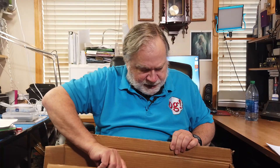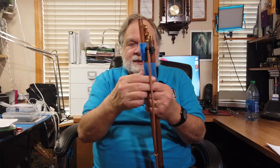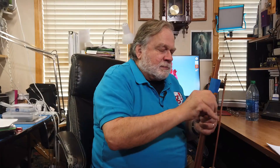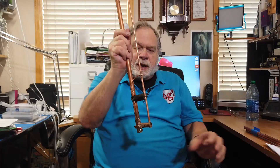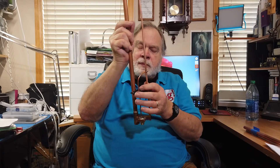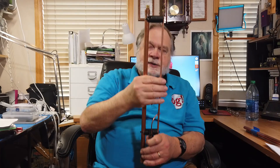What he's working on is the feed. The thing that bothered him was the fact that the feed is balanced, whereas the coax, of course, is not. So he came up with an antenna design and sent it to me. The interesting thing he was trying to do is a new feed mechanism. Instead of feeding it here and here, he's feeding it down at the bottom at the zero point and up at a slightly different impedance point, so that the feed down here is unbalanced. This is the feed section of the J-pole.